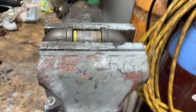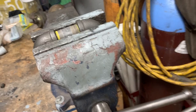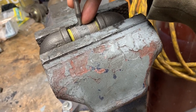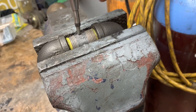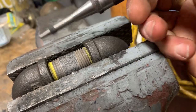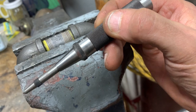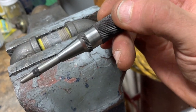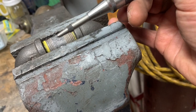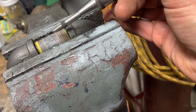I've clamped the workpiece in the vise. I'm going to take my center punch, stick it right about here, and go ahead and center punch it so the drill will bite. This is a spring-loaded punch — a really nice Starrett one. You can pick up an inexpensive one at Harbor Freight, or grind the tip of an old broken punch and give it a smack with a hammer. Then I'll drill the hole out to roughly close to half an inch diameter to give plenty of room for air to flow in.